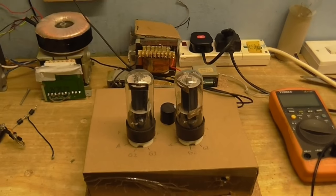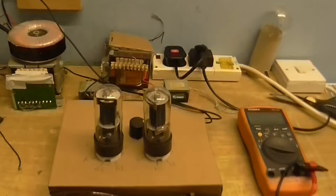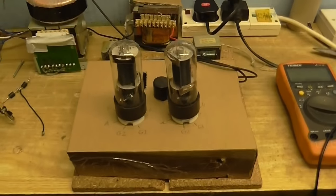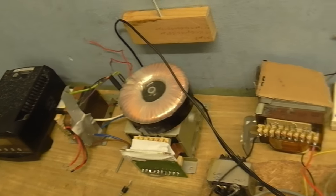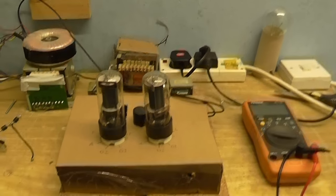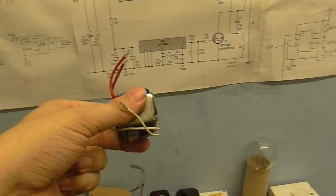What I want to do is come up with some kind of power supply for this. Because this is a tube amplifier, I simply cannot plug this into a phone charger and expect it to work. There are some things that do not work on 5 volts, and this is one of them. So I want to make a high-voltage power supply, and I've got quite a few transformers I could use for that. I also need to make a 12-volt supply for the filament. Although I have about 50,000 million transformers, I don't seem to have one that will do 12 volts at the current I need.